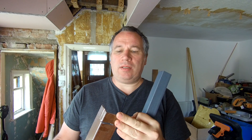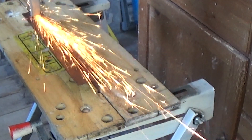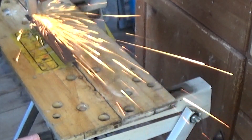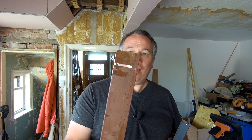Well, that's it — that is our test done. I don't know much about steels, but I've heard about the spark test and had a look at it. Whether this is hardened or carbon steel I'm not sure if they're the same thing, but as you can see with the hardened steel there are a lot more sparks and at the end they fork off in all different directions — little mini explosions. With the mild steel, quite a few less sparks, and the majority were just straight lines with maybe a couple of small forks. That's how you can tell whether you've got a mild steel or hardened steel, so hopefully you don't make the same mistake I did.